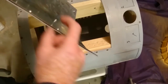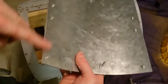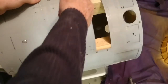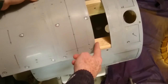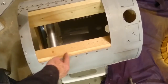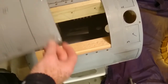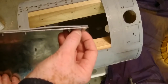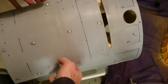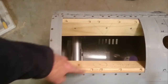I may need to squirt some more glue in here and clamp it overnight. Rather than grinding the rivet ends off — which makes the rivet loose and likely to fall out — I recommend putting the piece in place, marking the orientation of where each rivet lands on the wood, then drilling into the wood with a bit larger than the back of the rivet, say an 8mm bit, down about 10mm. That way the rivet ends won't foul on the timber. Just drilled in a little bit like that with the drill.